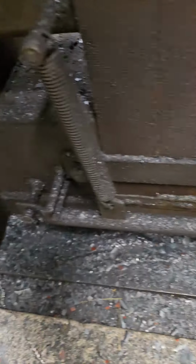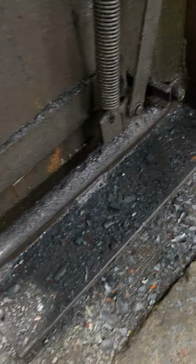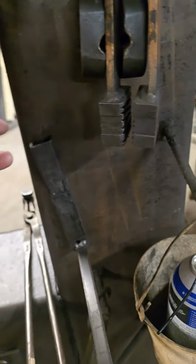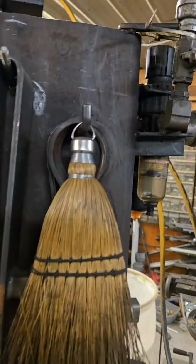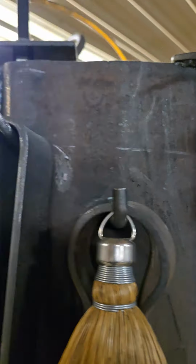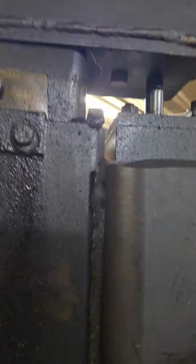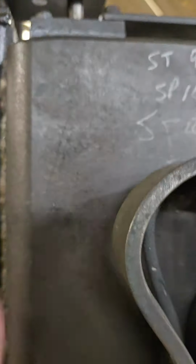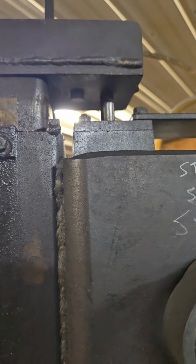I had a piece left over, and I set the bottom of the anvil on a large base plate of the same material. If you can see that down there. And then I used 8-inch thick wall tubing, that's like quarter wall tubing, to make the upright. And that kind of gives you access down inside here if you need to do anything. But then the cylinder, I made a head top piece on this, and so my cylinder is sitting here going up and down. Most of them, like the big blues and things you see, their cylinders go up, and that's great, it's fine, it works great.